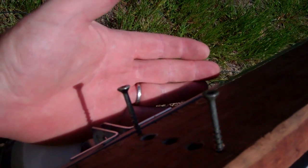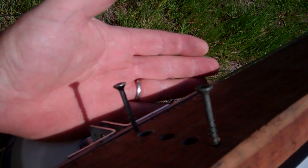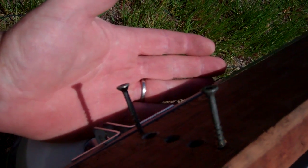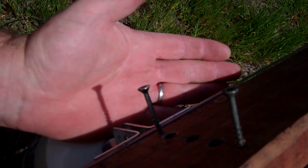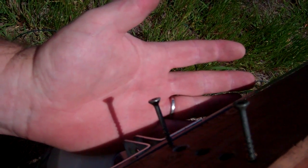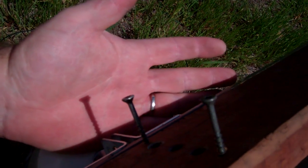If you see at the top of the solar array, I've got two screws at the same height and in line. And if I'm lined up with the sun, I should see a shadow that looks like a single screw. And you can see there's just a hair height difference in the screws, but the width is almost screw width,